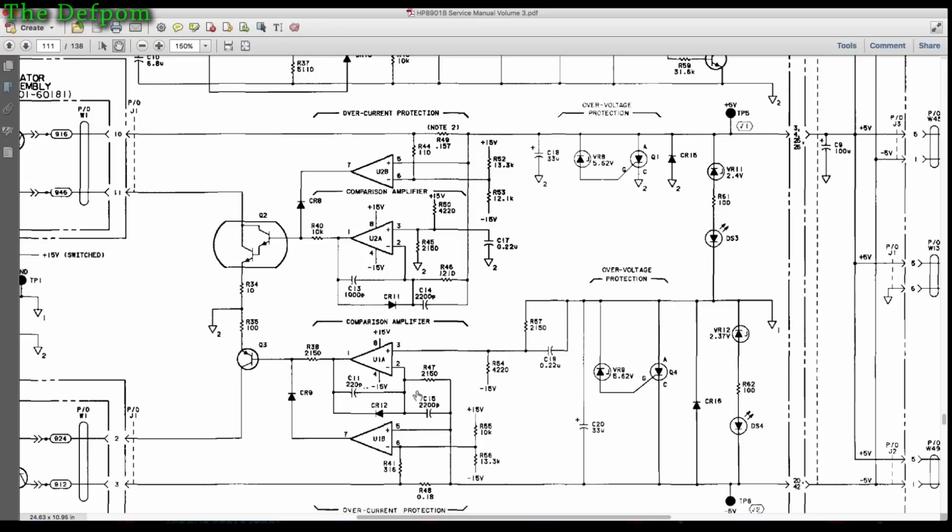And then it's got the sampling coming from this one here, and voltage dividers on this side. There we go, it is there. So you've got the minus 15 volt rail there, and the ground reference there, 0 volt reference there. So that's the voltage divider section here. Okay, so that's what they're doing, voltage dividing, comparing the two voltages, and then sending out correction voltages in order to close the loop and actually make sure it's running by reference.